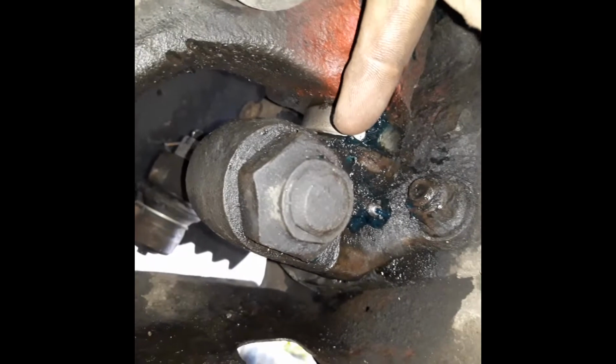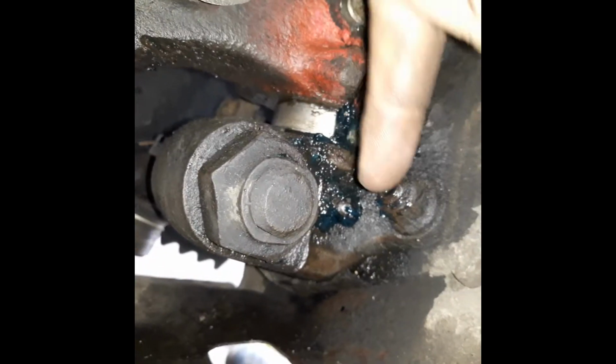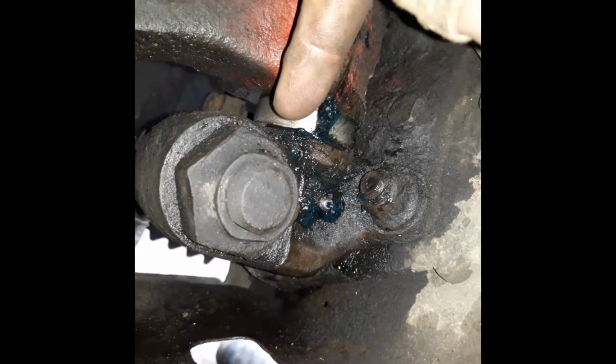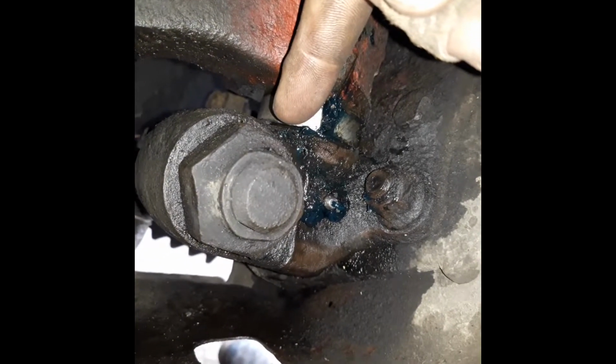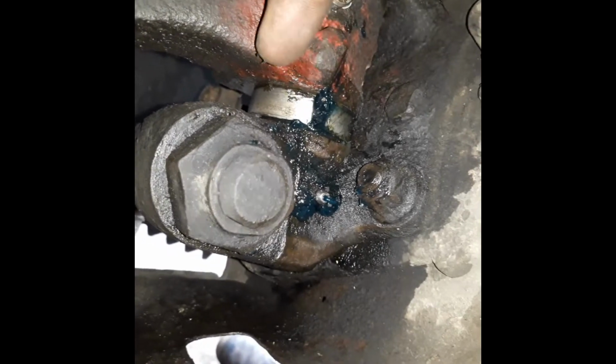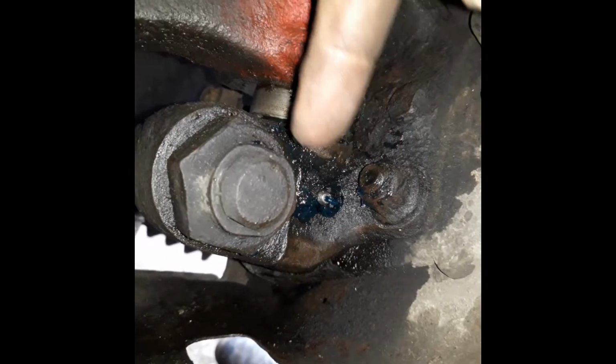So when I grease that, it sends it up and down. But on the bottom here, that bearing needs to get greased from that grease nipple. So you need to make sure that you see the small bit of rubber down here at the bottom. That's like a seal onto this bottom bit of the hub. Like on top is just flat steel. So when I grease that, the grease goes up there.